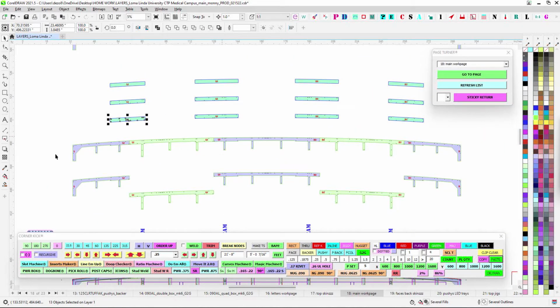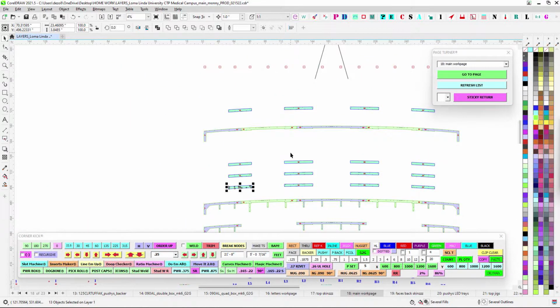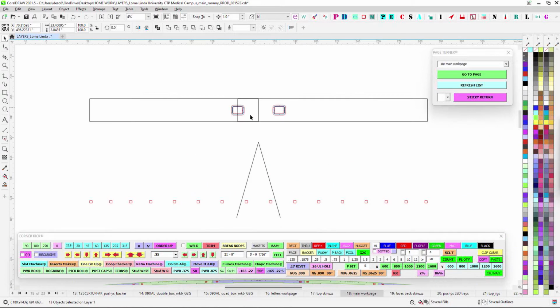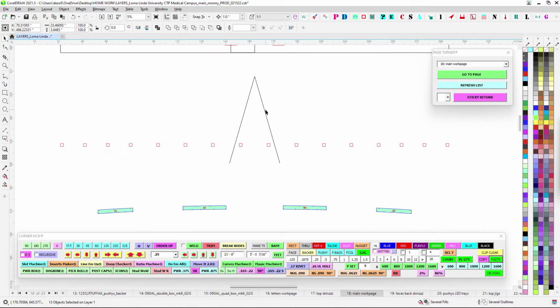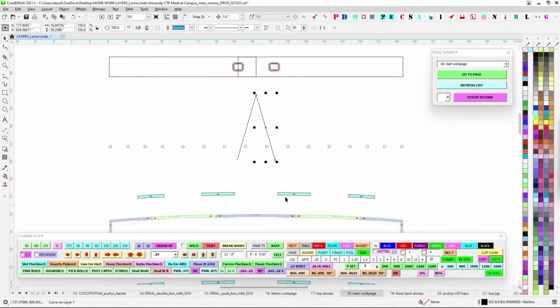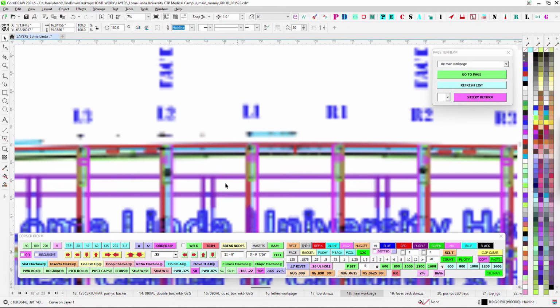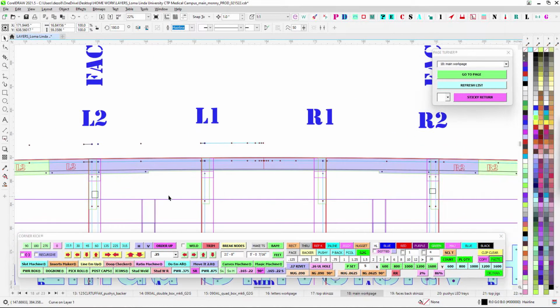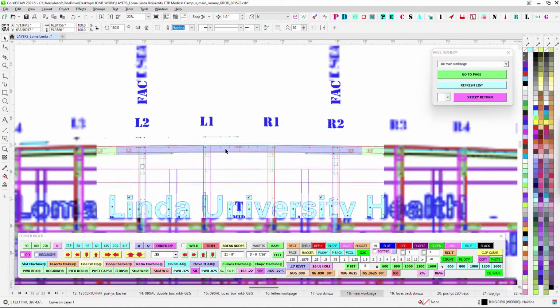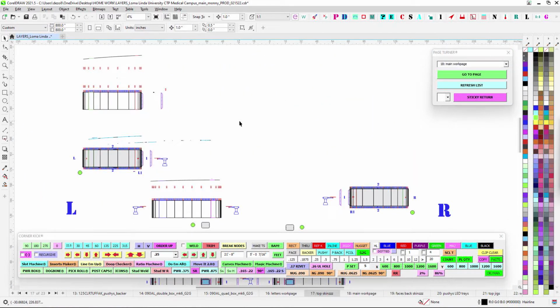So similar to what you do, you just do the top, kind of do that separate. The top will have lift point holes for install, 2 little hatches. These are 6-foot straps, and the 2 6-foot straps would get you right to this point here. So you'll choke the bar right next to the lift point right there, and then straps will go right out the holes. So top skins are on this page.